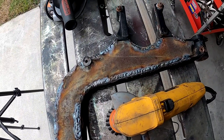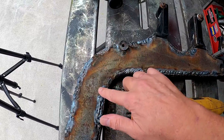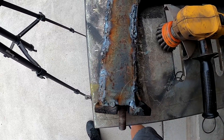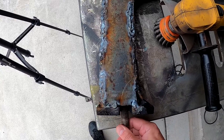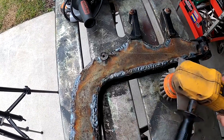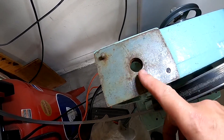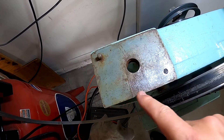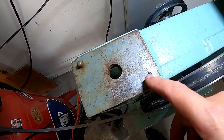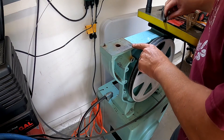It's all welded in for the most part. There are spots I didn't bother to weld - I was basically concerned about this area right in here. Down at the bottom I did weld it here and here to keep that gap from possibly separating out. The bolt is contained in there on its square washer so it's not going anywhere. I'm going to clean it all up and stick it on the saw. I took the overarm off and noticed one dowel is still intact, but the other one is broken off right here - the other half is up in the overarm casting, so I'll have to drill that and get a new dowel.